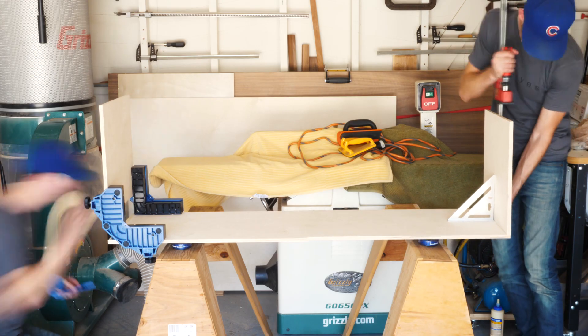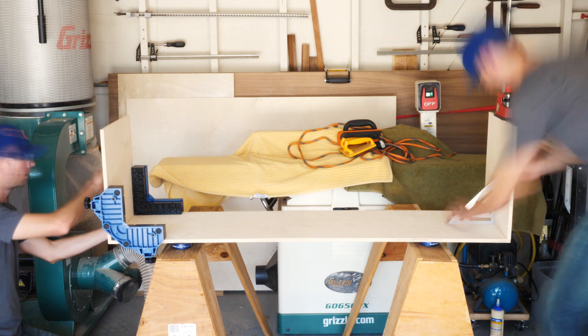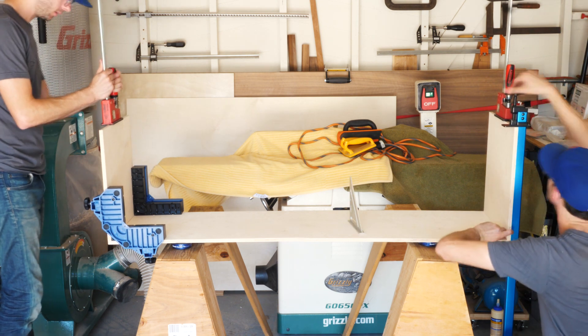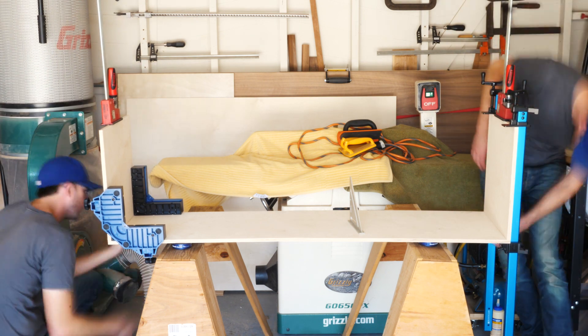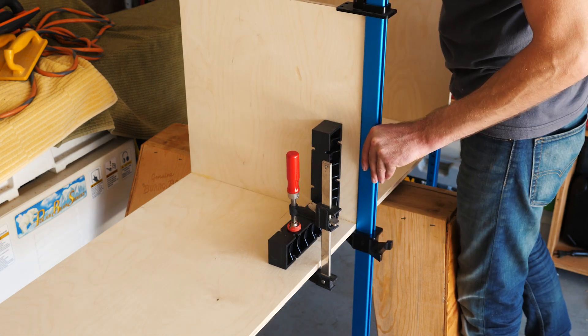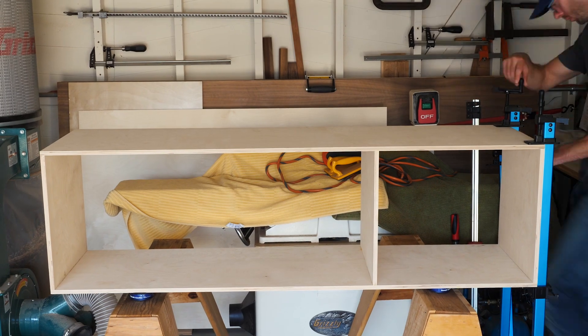At the very least you're going to need some glue and some clamps, unless you want to use screws or nails. You can see that you can do this with specialized tools like the corner clamps I'm using on the left side of your screen, or by simply gluing and clamping like I'm doing on the right hand side. Next I glued in my vertical partition, and then once all of those were dry after about 30 minutes I glued on the top.